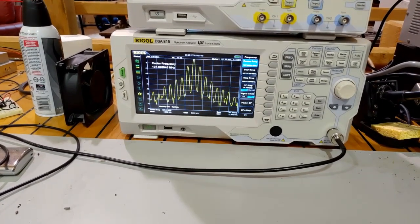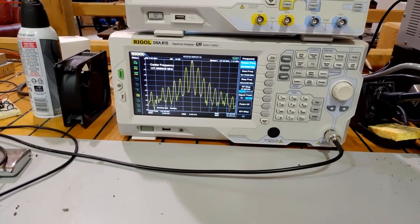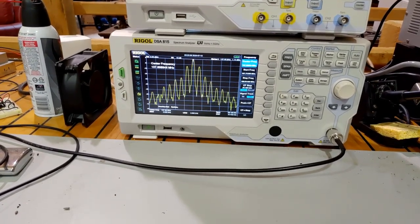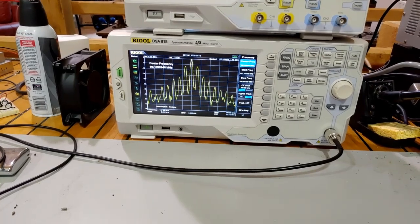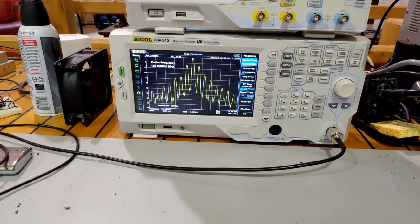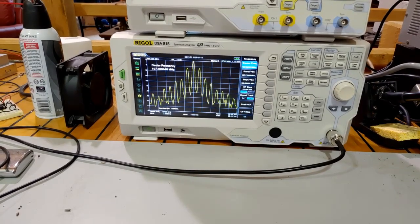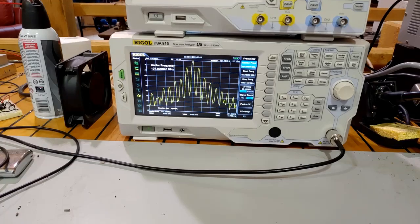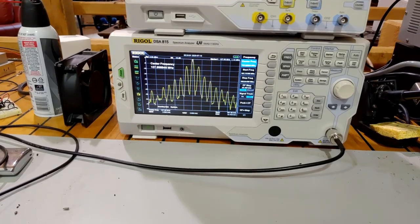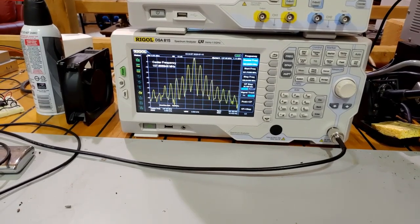As you can see, BH chip transmitters are not particularly good, but they're not nearly as bad as the GD transmitters. When you run them in mono mode it's fantastic - very, very pure. In stereo mode it spreads out so much that you're wasting a ton of your power in the sidebands. So if you want to use this transmitter or any BH chip transmitter - a BH1415F, a BH1414K - you're going to want to run it in mono mode for a lot better performance.